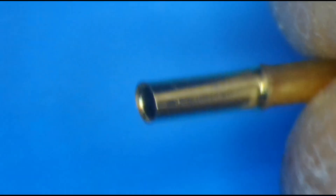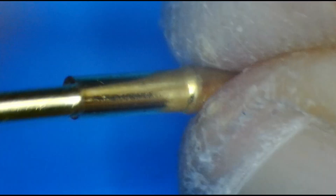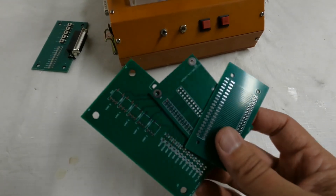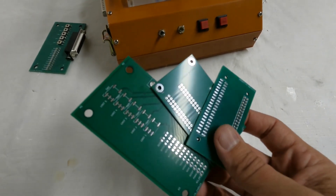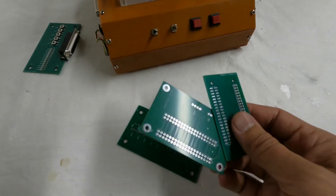The pogo pins have two parts. The replaceable pin fits inside the tube that gets soldered to the fixture. I made custom boards to solder the pins to, so they can be located accurately. 3D printed brackets also help adjust the pin height and location.